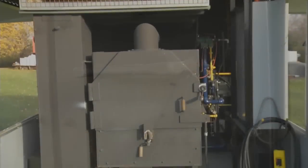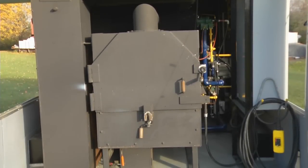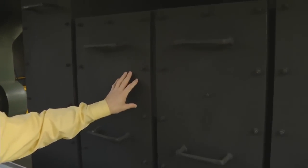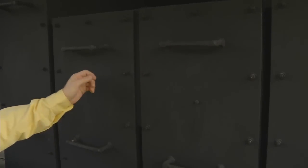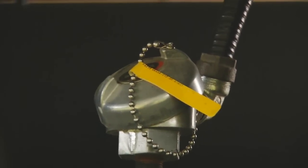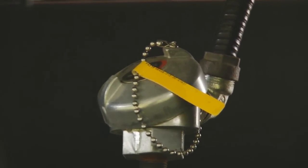We have our large standalone re-burn system that operates at 1,750 degrees Fahrenheit. It has removable steel plate doors and two inches of insulation inside. The plates can be removed for inspection and relining, and this is also where we monitor our afterburner temperature with our temperature probe here.